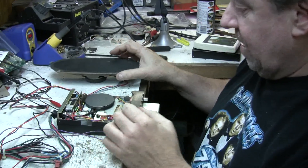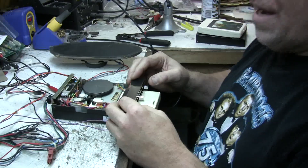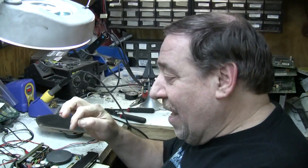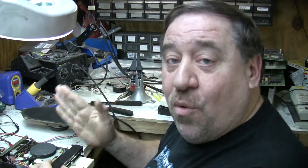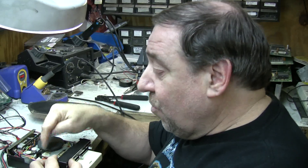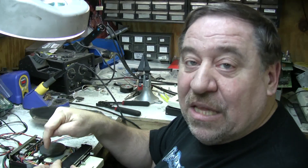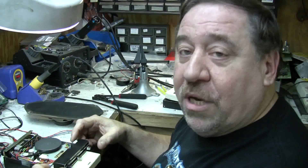As you will hear, there's even a little music courtesy of the 8-track player. Now it is looping. What I wanted to tell you is it's only recorded on one track — the head never moves. Track one is the only thing that has anything on it; tracks two, three, and four don't. So what they do on these 8-track tapes is disconnect the automatic track-switching feed, which is what we did, so it's only on this track.